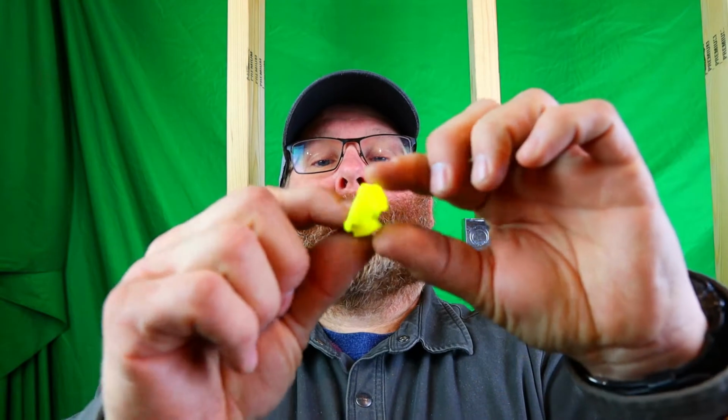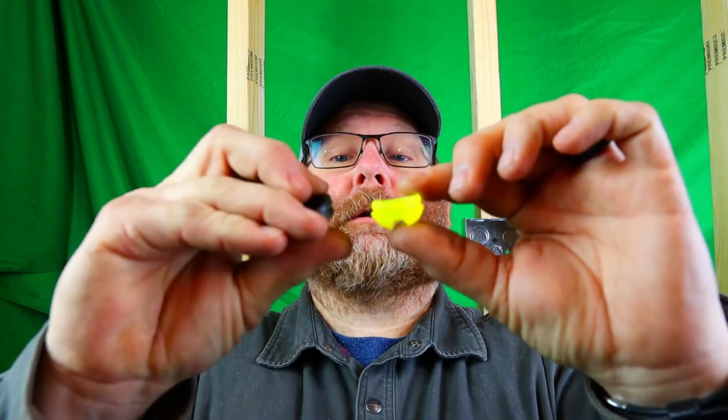Really like these because they're so freaking thin, as you can see. I mean, the lip is very, very thin compared to this fat one. Now, they've got both good things. So, this one, when you're pulling the Romex in a box, they don't allow the connector to pull straight through. Sometimes when you're pulling Romex, it's very seldom, but sometimes these things are so thin they'll actually pull through the hole. I still love these to death. These are good, but they're harder to put the Romex in, but they don't let the Romex back out. You have to pry these suckers out.